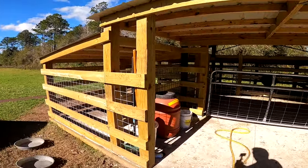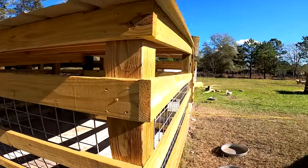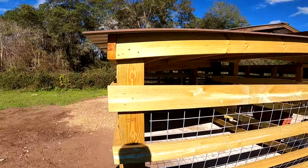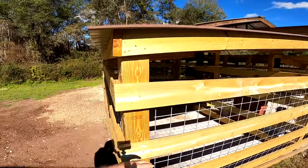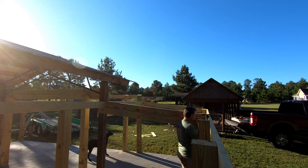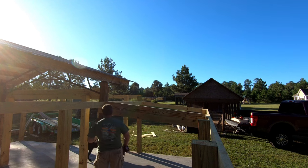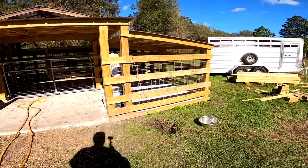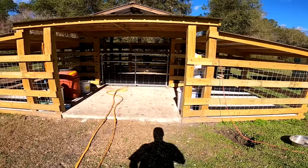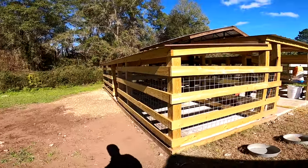Going in, all of the posts were set in line with the original six-by-six posts off of the original pole barn. Once those were set in line, I tied the exterior posts to the interior posts all the way around — that's what set up what were essentially lean-tos coming off of that central pole barn. Once all the posts were set and tied into the main frame, we poured the concrete. The total footprint is about 28 by 28 feet, and altogether there are five livestock pens in this barn.